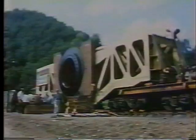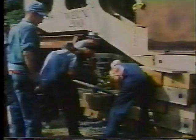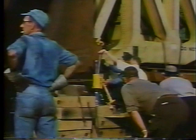Meanwhile other parts began to arrive by rail from the fabricators' shops. The hub of the yoke was among the first. This piece, which bolts to the north end of the polar shaft, required a special railroad car to bring it from East Pittsburgh to the siding at Bartow, West Virginia. It was desirable that the yoke hub weldment be fabricated in as large a piece as possible under controlled shop conditions, so that this 137-ton nickel steel casting welded to six-inch plate could be heat treated, radiographed, then precision machined to fit the sphere.